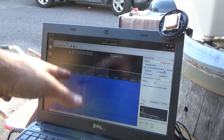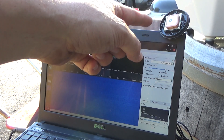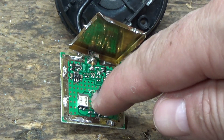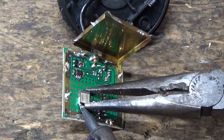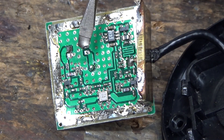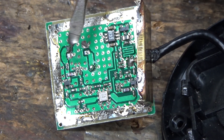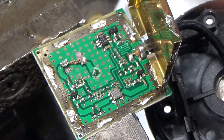This is a GPS signal, and I don't need the dish for this — I'm just using this little GPS L-band patch antenna. I've started to take it apart because you can actually do other stuff with it. I'm going to open up this GPS antenna and remove the bandpass filter — that's this little block marked 1575. That will open up the antenna to receive more of the L-band than just GPS signals. We've got the filter off. Now I need to jumper the input and output. You can see the traces coming in here — one is input, one is output, the other two are ground — so we just need to jumper these with some wire. My soldering skills are poor to none, but I think that's a good connection.